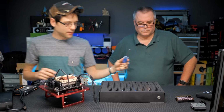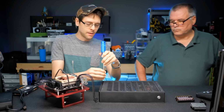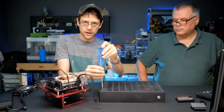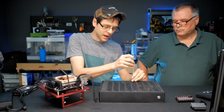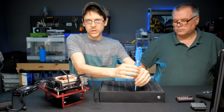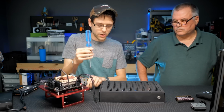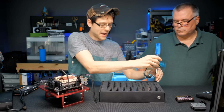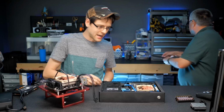So I'm going to open this up. I would give you the honors, but this is one of the first powder coat minis I did, which I had to do a lot of replacements for, guys. That was one of the big dramas I had getting to manufacturing, because I spent tons of money training the people that manufacture this how to powder coat. I would send them the actual powder, explain the prep and everything, and we actually went over there and taught them. Then when it came game time, they just basically sprayed dirty panels, so you had a lot of chipping and flaking, which was not good. I ended up having to reclaim and repaint a lot of the original S4 Mini Classics. But overall it was good because I got to take the Classic back here locally to have powder coated myself, and we did all sorts of really cool, interesting colors. So it was not bad.